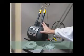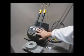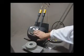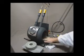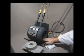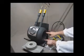We're going to start off with the actual forge chamber. It features a stainless steel logo, Mark II as indicated there, so the Black Dragon logo on it. It's a dual burner forge of the Venturi design. You have got the forge chamber cast out of a high heat refractory cement. This is rated at 1600 degrees Celsius. The opening here is 160 millimeters diameter.